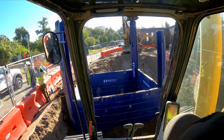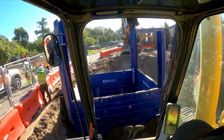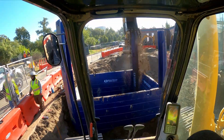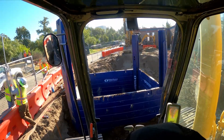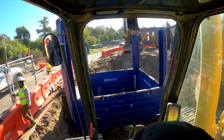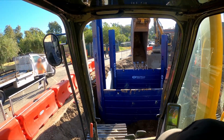We'll get started with bashing in these pillars in the corners. We're moving them down along the slide panels that we've installed. The upper panels are in place, so we're going to start digging our way down and beating stuff into the ground slowly. These pillars don't have to go in all the way to the bottom of the dig — we'll feed them in as we do our digs so they're held in place by the walls.